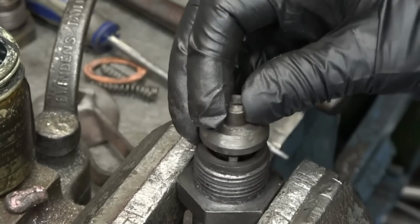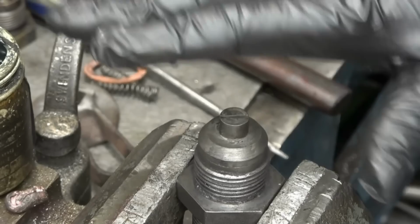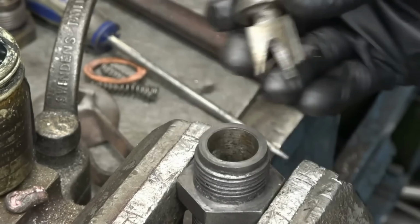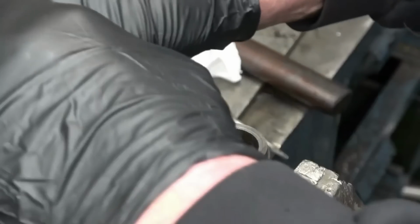This is the actual valve, the one-way valve. It sits on a seat like that. Water goes behind it, lifts it off the seat, and steam pressure on here keeps it pushed shut. There's a slot in there to enable you to grind the valve in situ, and that's actually inside the Clack valve housing. So we're going to do it here.